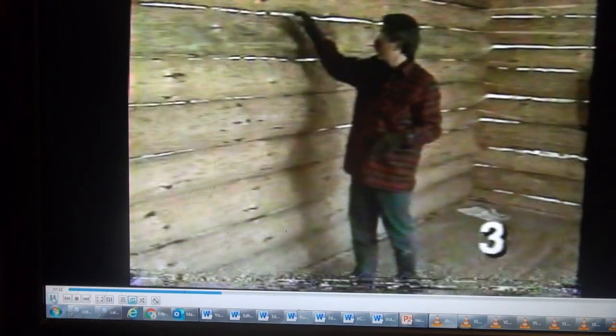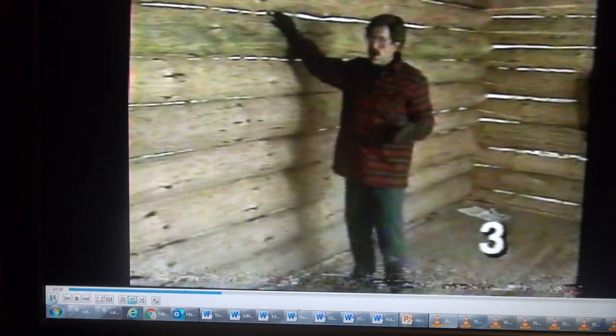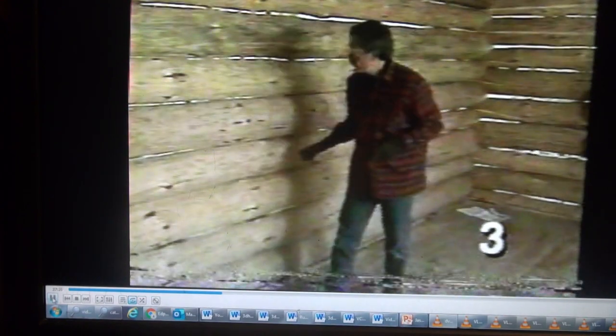When the home was manufactured, they put metal rebar on both sides of the window to help support the walls. But because we have such a nice lake view here, we took our double window and expanded that to a triple window, which moved this side of the window out past this rebar. So if we cut out the logs we'll remove this, which isn't really a problem because we'll put bucks along the windows nailed into the logs — those will help support this wall here.